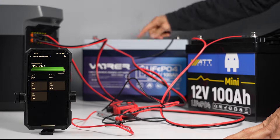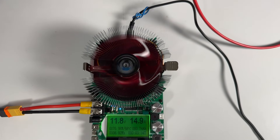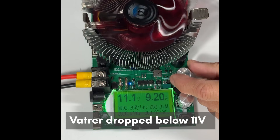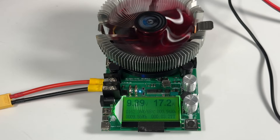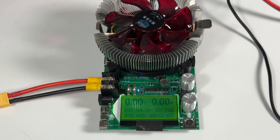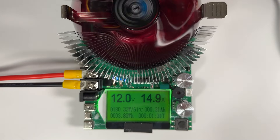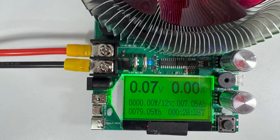My next step is to do a discharge test to see how much juice is left in each battery. As soon as I started the discharge test for the regular battery, the voltage dropped immediately below 11 volts and continued to drop until it was fully discharged — meaning the remaining capacity is barely usable. The meter shows only 10 watt-hours remaining. For the mini, it maintained over 11 volts until the last few watts, and the meter shows 79 watt-hours remaining.